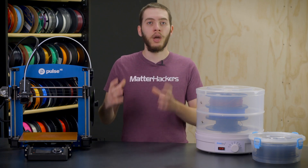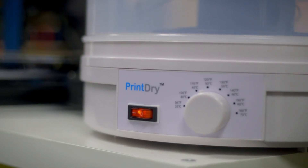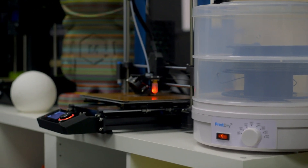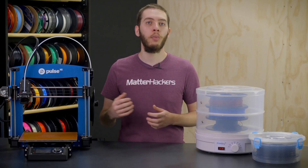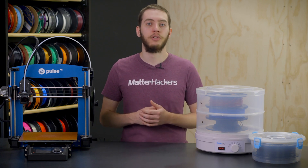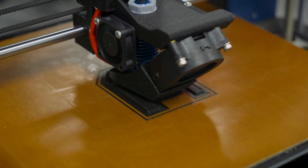What you'll want to do is dry out your nylon before you ever use it, or in the best case scenario, print directly from your drying apparatus. Personally, I just print directly from the printer dry box because it makes it easy by actively removing the moisture from the environment around the spool and from the filament itself. With small ports on the side, you can print directly from it. Wet and dry nylon have clear differences: wet nylon will pop and hiss as it extrudes, it is more opaque, with poor layer adhesion, poor bed adhesion, and poor retraction results. Whereas dry nylon will extrude without noise, it is more translucent, stronger overall, and has reliable and consistent printing performance.